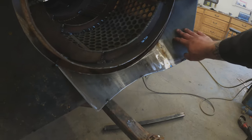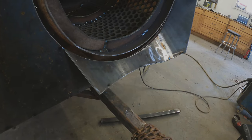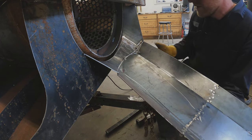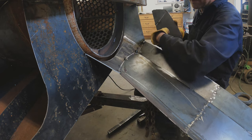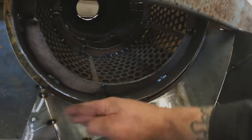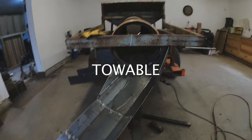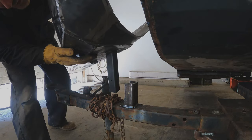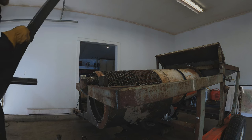For the tailing chute, I whipped up a little curve — it's a little tricky going from something round to flat, but we need a chute to get rid of the coarse tailings away from the trommel. I built a piece for this corner so the tailings coming up and over the barrel go the right direction. There's also one more filler piece. The coarse tailing chute is removable — the hitch is located right there and this thing would not be towable otherwise. We use one and a half inch square bar to slide it in and pin it into place. During transportation you just set it there.